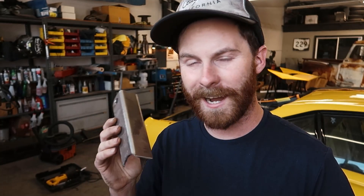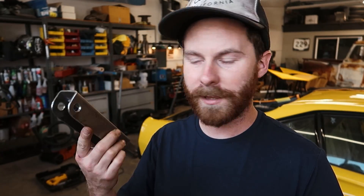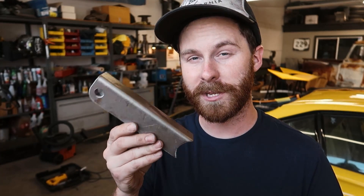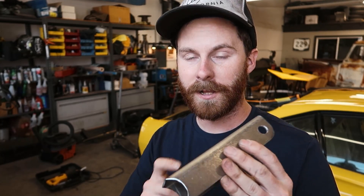While I have this thing off, I'm going to add some holes to the top of it — I think it'll make the part look a little bit better. That probably would have been smarter to think of this morning when I drew the part in CAD, because I could have put that as part of the template. With that said, I don't know that I'm going to keep this part long-term — if I have my way I'm going to redraw this in CAD as a billet aluminum arm and have a buddy machine it. But I need something there now, so let's throw some holes in this thing, clean it up one more time, and then we'll weld it.